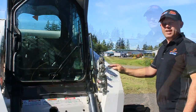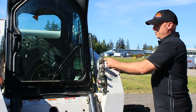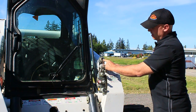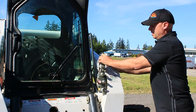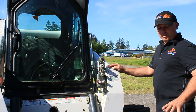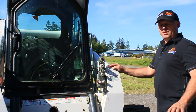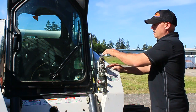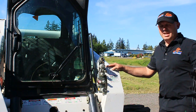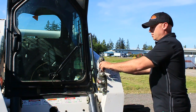The next connector I want to talk about is the Bobcat 7-pin connector — it's usually in the top position on your machine. If you take the cap off, you'll see seven pins. This is a serial bus connection that runs out to the attachment. Each attachment available from Bobcat has a little computer on it that connects back to this, which then connects inside to your internal computer and allows you to use your joysticks to control the attachment.